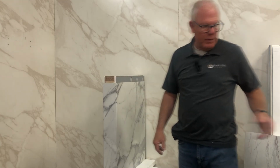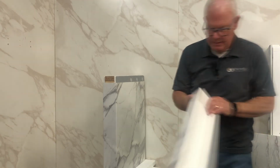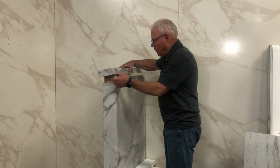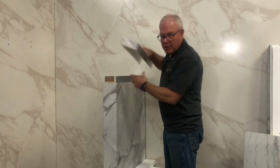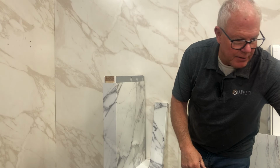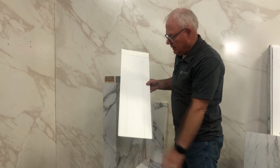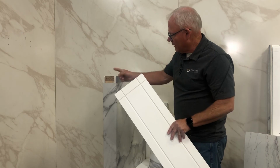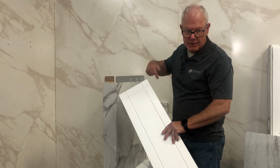And again, there are a few ways that we can do this. Our objective is a cap piece just like this. That's going to go over like that. Now, to accomplish this, again, you're going to have to figure out how wide and make your V's in the right spot. 5 inches center to center. And the fact we're going to wrap the front means you're going to have to do the exact same thing on this edge here.